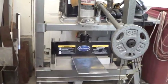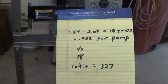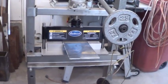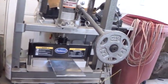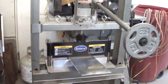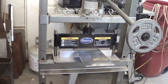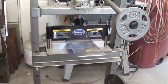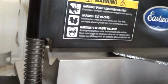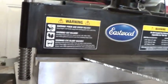You take the seven and a half pounds times 327 and that's the most force being applied on the aluminum. Let's keep bending this a few more times, because right now the aluminum is still probably in an elastic deformation mode and it's just going to snap back. It's going to get a little bit harder to bend as it bends further, so we've got to bend it more before we figure out the maximum. After a few more pumps, it's really starting to bend.